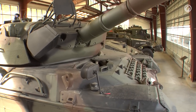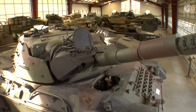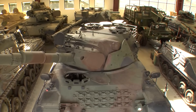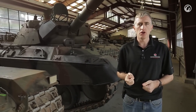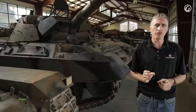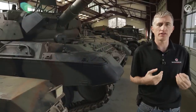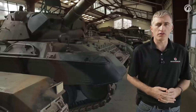The vehicle behind is technically a Leopard 1 A1A2. Starting from the basic Leopard 1, additional armor was added — you can see on the turret front and on the mantlet an extra layer to defend against more recent ammunition types, mounted on rubber blocks giving a spaced effect. The A1A2 upgrade came with the introduction of the Leopard 2 into service; earlier Leopard 2s had a low-light television camera that was subsequently removed and mounted on the front right of the turret mantlet in a small cage. This was a passive image intensifier system — not a thermal imager, but a vast improvement over the active infrared system used previously.